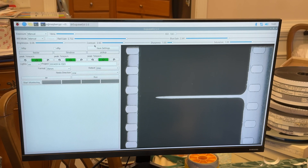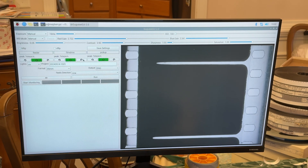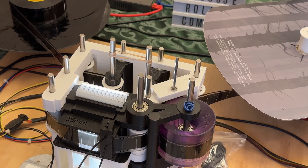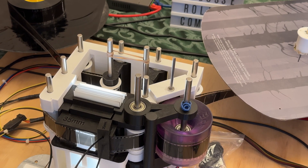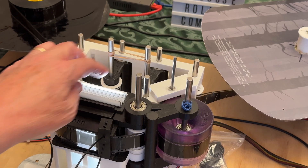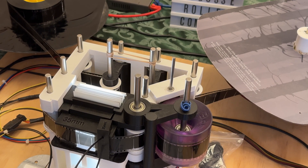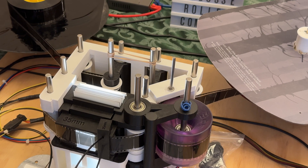So as you can see our film has been loaded in there — you can see the frame lines but they're not in the right spot. Over here where the frame lines are, the frame line is in the wrong spot, so what we're going to do is adjust that. These control the motors that control everything; we can use this one here to hold the film up a little bit. This is one of those things where you kind of get a feel for where it belongs. Next we need to get the tensioners in the right spot — that's these two bars here — and they're moved by using a control on the screen for each of those. What we're trying to do is move those tensioner bars so they're about even with the front. Now they're about in the middle where they need to be.